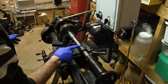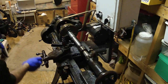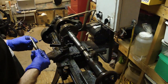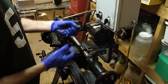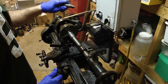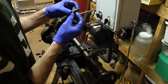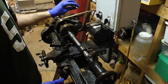Now that I have a register, there's already a center there. Let's knock this loose - I'm done with this setup. My plan, since I don't have a center to drive this, is to put some pieces of cardboard or shim stock - I could cut up a piece of aluminum can, something soft metal here - and drive this center. And I need to skim it to true it; it's gnarly on there. So I need to true this up to the center anyhow.